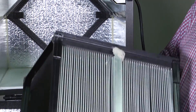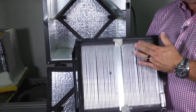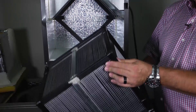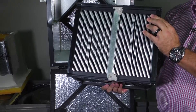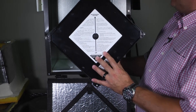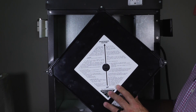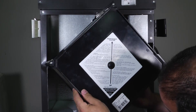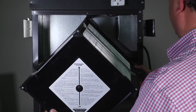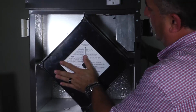When it comes to maintenance on an HRV, at least once a year I want to take this core and submerge it in water so that water can pass across it and clean out any air passages inside of it. I'm then going to let it sit and dry for usually about a day and a half to two days to make sure it's good and dry. I'm also going to notice that where the arrows say 'up,' I want to make sure that points up. I'm going to look at these tracks and get all four tracks to line up as I slide the unit into place — there are ones on either side and it can be tricky — then grab the back of the unit and slide it into place.